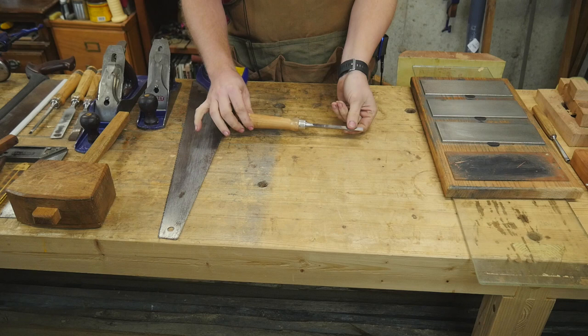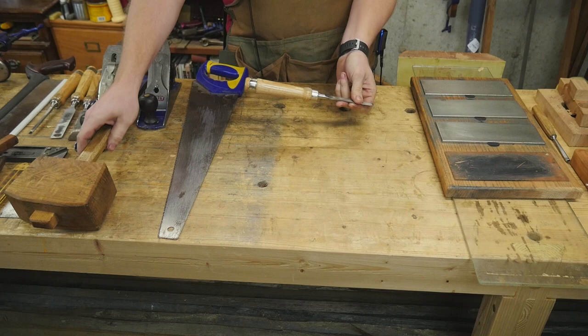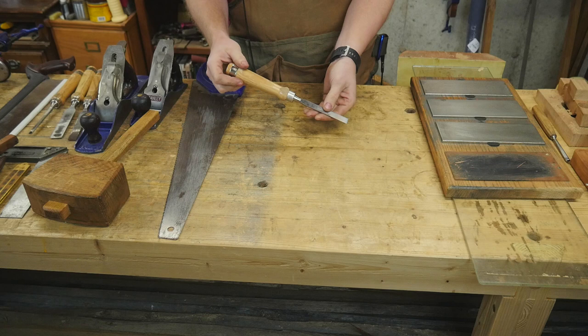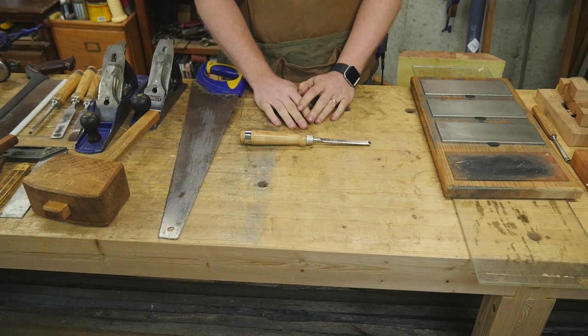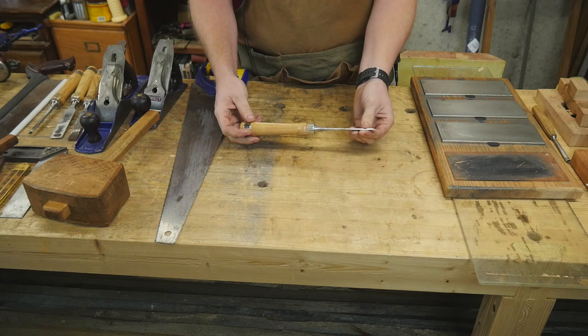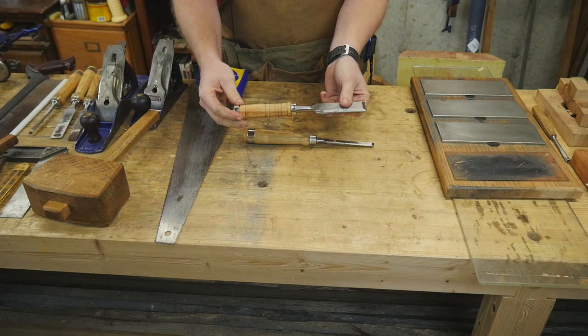The first and most basic tool is a good half-inch chisel. This is the most used tool in my shop — the one I grab constantly. Really, you can do everything with this. Every other tool in the shop is just a way of holding or a jig of a chisel. Get yourself a decent chisel right off the bat. When I say decent, I don't mean dump hundreds of dollars into it. This one I bought from Aldi, the grocery store. The Harbor Freight chisels are what I started with — for the price, you can't beat them. Are they going to last long? No. Is the handle great? No. But for the price, these will get you going and get you into woodworking.